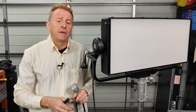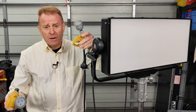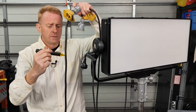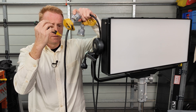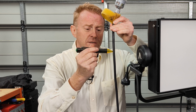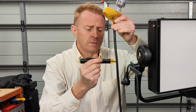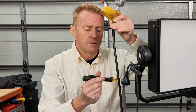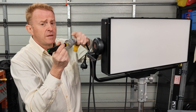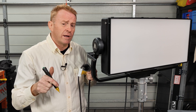Here's a scenario that can really trip people up. I've got one power cable running off the power grid and another running off a portable generator. The cable from the grid reads fine, but the cable from the portable generator — it can be very hard to find voltage on this. You really have to search for it, and even going into the end of the connector, sometimes you might not get a reading at all. Portable generators and volt sticks are not a great combination for testing.